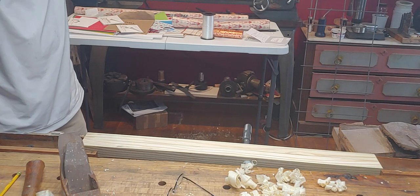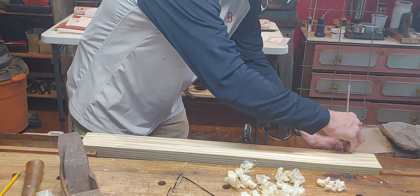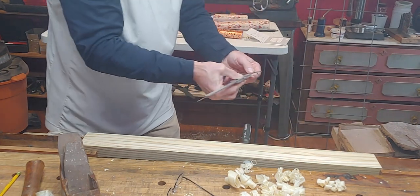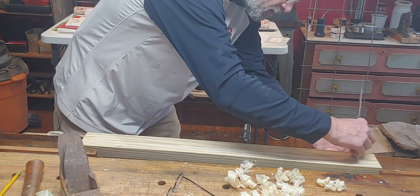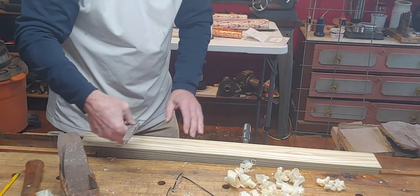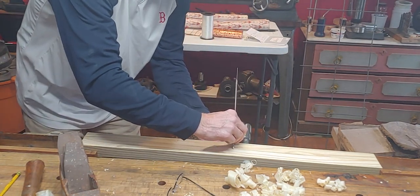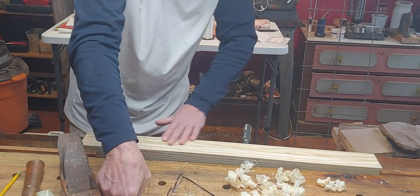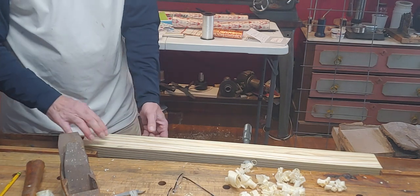When I'm done here, I'll take this plane apart and show you the components. So 32nd under, it's just 32nd over an inch and 3/8, 32nd under an inch and 7/16. It's 3/64 thicker on the other end right now. Yep, 3/64 thicker on the other end. And I'll just check the middle without putting a straight edge on it. Yep, exactly. So it's pretty flat this way. There's not really any belly in it without putting a straight edge on it.